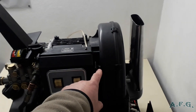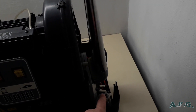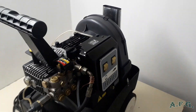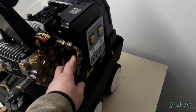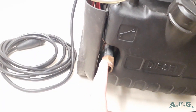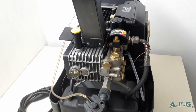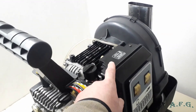There is a ventilator that cools down the engine, and here is the chimney. There are two spark plugs. This copper wire is a sensor that sends information about how cold the cold water is, because cold water from the pump runs through this pipe. On this pipe there is another copper wire — you may not be able to see it — that sends a signal about how hot the water heated in the double coil is. When it reaches a maximum of 90 degrees, the thermal fuse switches off the burner.